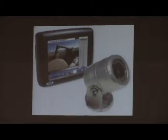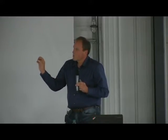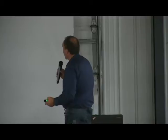We use RTK. We've used RTK for 15 years for cultivating. And I also use a steerable quick hitch. So sometimes even with RTK, your tractor might be right on, but maybe your cultivator, maybe there's something funky in the hitch, or maybe you're on a little side slope or something, and you can just dial that half inch or that inch, you know, that you need to bump over. So I really like using that.